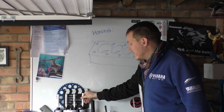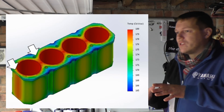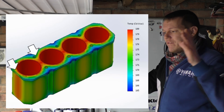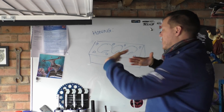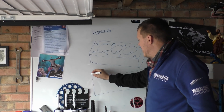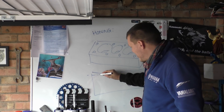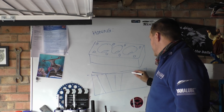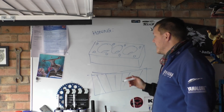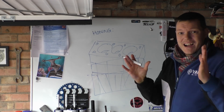What you do is it's there to simulate the head, and this is to stop the cylinders warping. Because the middle cylinder, if it's saturated with heat and hot oil and stuff like that, is basically stuck, but the outer cylinders have cylinders on one side but they're free on the other. This can cause the head to warp, the deck to warp like this. If you hone this and you let the metal relax back to cold again, that means your cylinders are going to be like this — obviously that's an extreme exaggeration — but they are not going to be straight.